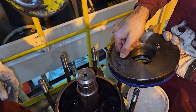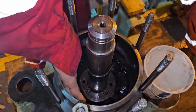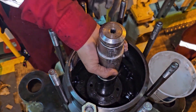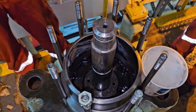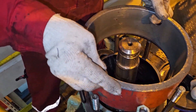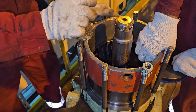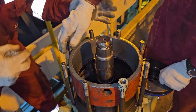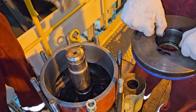My team had already completed this part before I could film it, but I'll show you now. Apply lubrication — silicone grease — inside the cylinder. For fixing the piston, use the special tool so you don't damage the seal ring while inserting. Fix the tool in place, make sure it sits properly, give a little tap so the tool is in place. After the tool is in place, apply some lubricant again.